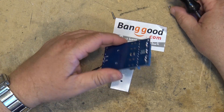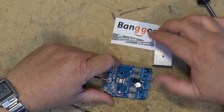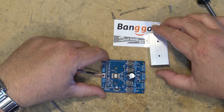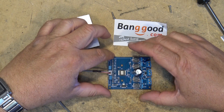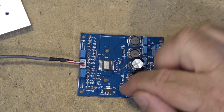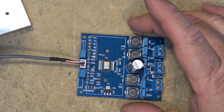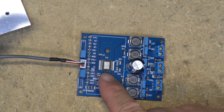Let's pop out the two screws that hold it together. Hopefully I'm not going to break anything doing this. So it's a single big chip here, and I noticed one thing — there's no thermal compound on here, which is kind of shocking. I would have expected to see some thermal compound. We'll rectify that when I put it back together. Basically, as you can see, it's a single chip solution. Everything is built into this one IC, and these inductors here are your filtering on the output.